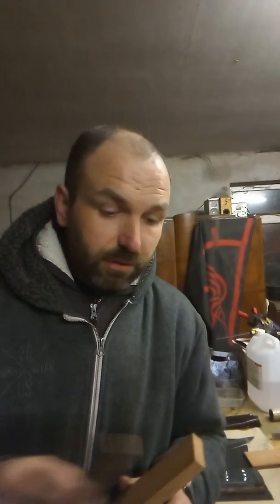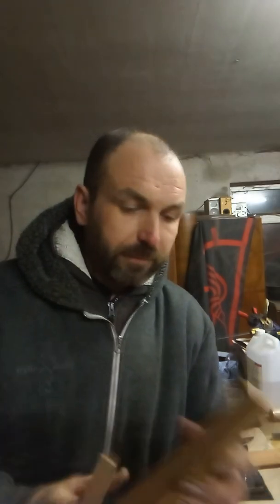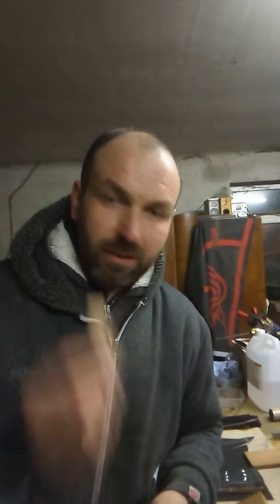A strop is leather, and I find it a lot easier to use if it's attached to a nice flat piece of wood — that's all you need. Just a thin slip of leather; it could be an old belt, something fairly thick. It just has to be a thin strip with a nice flat piece of wood, as flat a surface as you can find. I usually use offcuts of leather from my leatherwork to touch up my leatherwork cutting tools every once in a while.